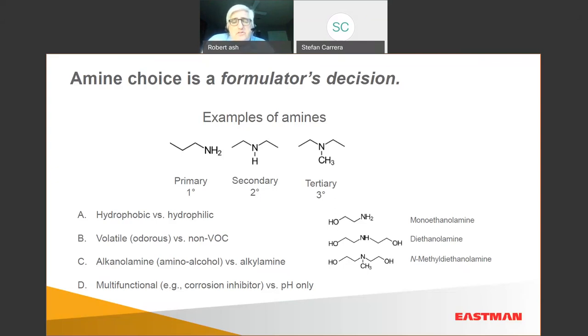Other things to consider when thinking about amines: is it hydrophobic or hydrophilic? HLB was developed for surfactants — specifically non-ionic surfactants — but we've adapted it to look at how water-loving versus oil-loving something is. When you're talking about an emulsion, HLB is important. Knowing the HLB of the amine can help with formulation decisions, and also when substituting amines — an amine with an HLB of 12 substituted for an amine of HLB 10 might not be a drop-in replacement.